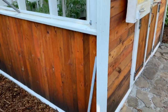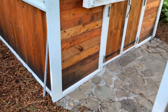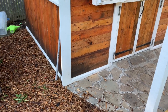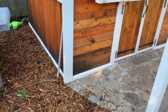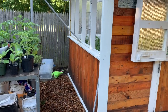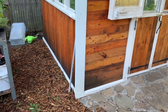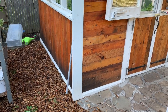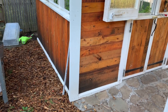Let's start from the base. I have some still shots — I really wasn't planning on putting this on YouTube. The frame, which you can't see, is four-by-six pressure-treated lumber. The dimensions are eight feet deep and ten feet long. I shiplapped the joints, squared it up, leveled it out, and put it right directly on the ground.